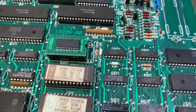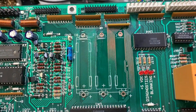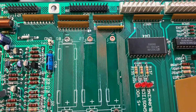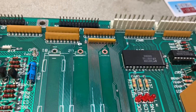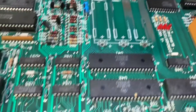A Space Station MPU that I've just finished repairing on the bench, and I'll take it over to my test rig. It had some alkaline corrosion up here. Fortunately, none of the traces were severed, but the 4.7K bus pull-up resistor was damaged, so I replaced it.